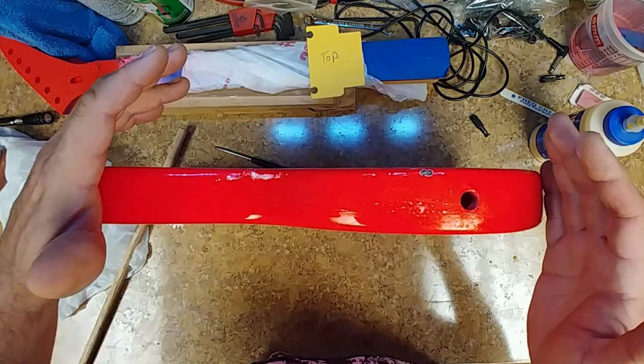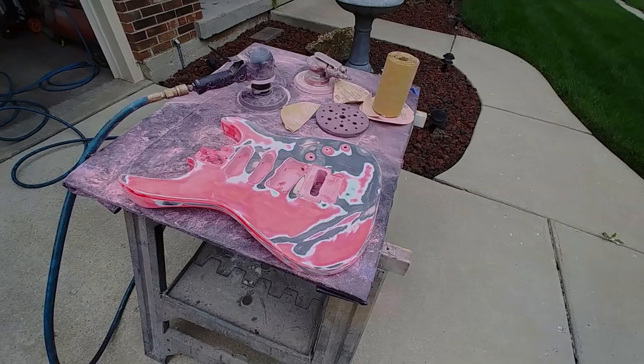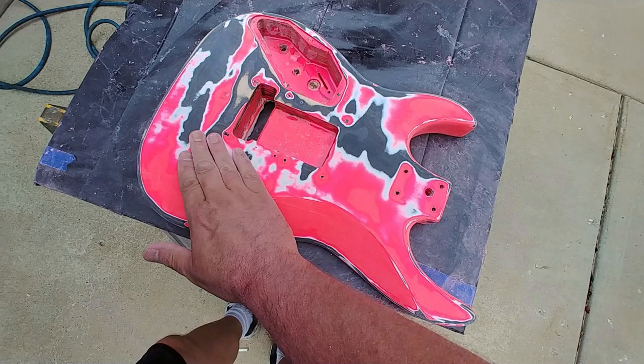I ended up finding a lot of cracking going on around the edge of the body, kind of where the layers of plywood are glued together, and it was through the finish. A little trick I learned to fix them is using thin-set CA glue. Working it into the crack — since it's thin-set, pretty much like water — it'll work its way in. Then you build it up a little more until the crack is completely filled. When I do my sanding, the crack is basically going to disappear.